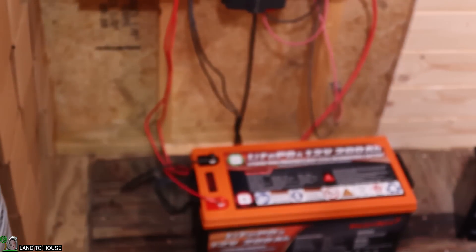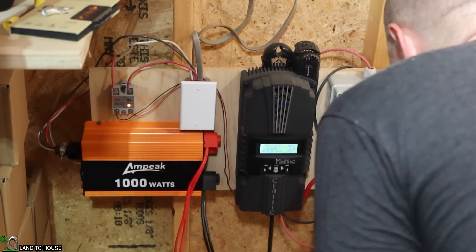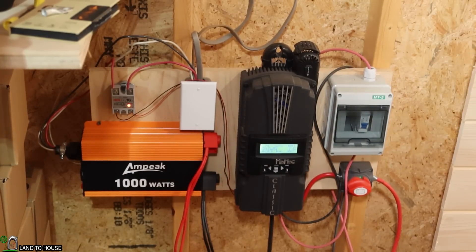Now I'm turning back on the studio lights — and there we go, looking good. The battery voltage is 13.1 volts. I'm going to flip on the solar now. I've only got 25 watts coming in because it's overcast. EnjoyBot has several different batteries available. This is the 12.8-volt 200 amp hour, 2,560 watt-hour model. If your inverter can do 2,560 watts you'll be good. Any more than that and you'll want to step up to a 24, 36, or 48-volt system.